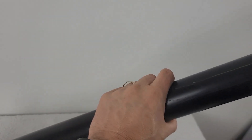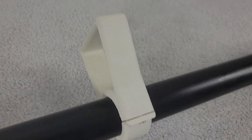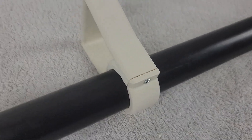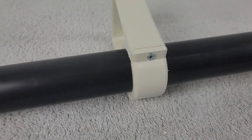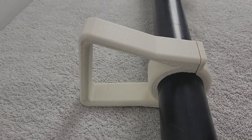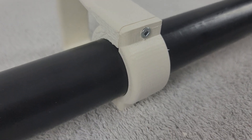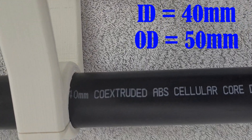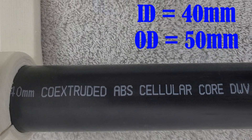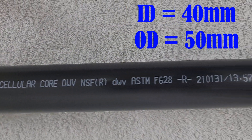Now let's follow the shaft up to the next 3D printed part — the handle. It's a piece that clamps right onto the shaft of our trimmer. Two parts make this work: the handle part and the bottom cap piece that allows you to fasten it. This is actually ABS pipe rather than PVC — it works a little bit better for what we're using it for, and it's 40 millimeters in diameter.